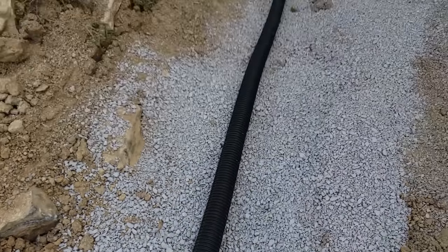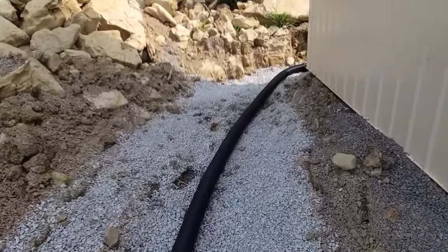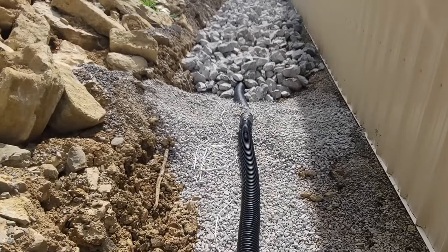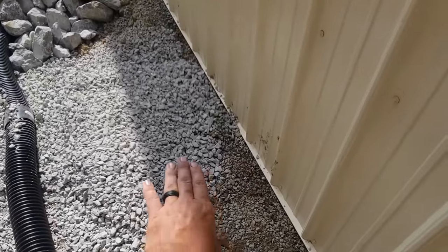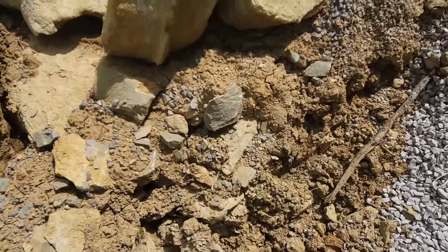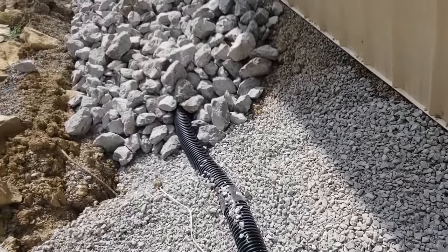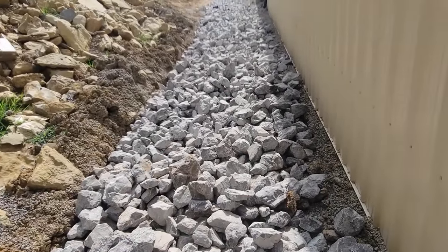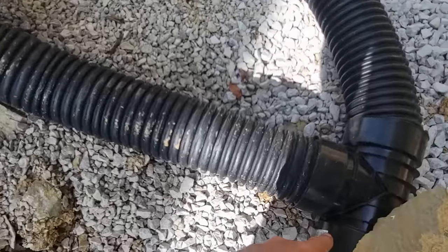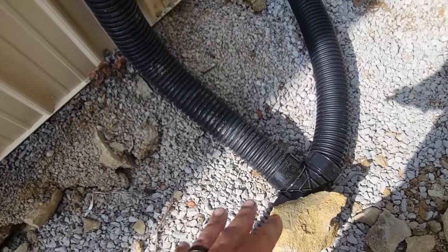But it'll help keep the ground from flooding and pooling back here, which was one of the bigger issues — Jessica sent me photos and it was a complete lake back here. Water would come back here and splash up against the tin and sit. It's not going to go this way into chert rock and clay — it's going to find its way through the sill across the concrete. This was widened and brought back. And the company that's out here this time is putting in the actual fittings. Before they were just pressed together and leaking and it wasn't really moving water very correctly.